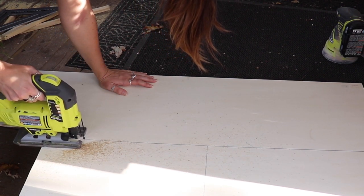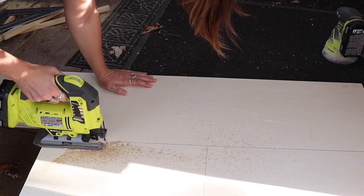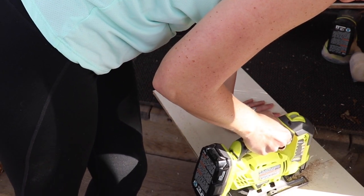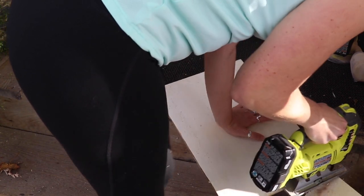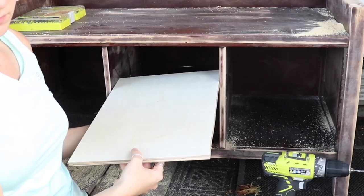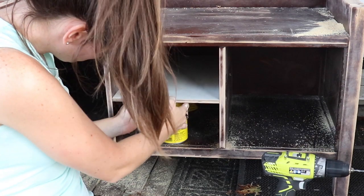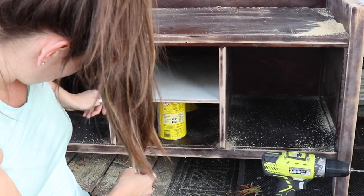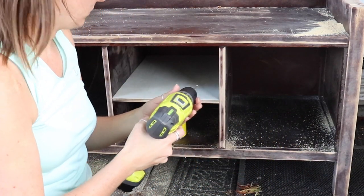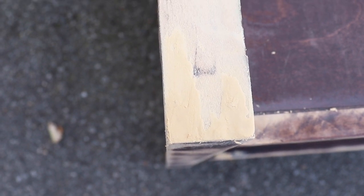I wanted to add in some shelves. I had previously done a cube shelf and created shoe storage by adding shelves in between the cubes — they're long enough that you can actually stack two pairs on top of each other. I originally wanted to add two shelves on the outer boxes but there were some weird indents and it wasn't going to be easy to cut the shelf to fit, so I went with the middle option. I cut that out of half-inch plywood and used some canned goods to prop it up, which was actually perfect because it was centered for the boxes. I made sure to drill pilot holes first, then screwed it into place.